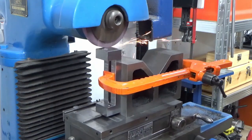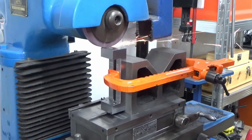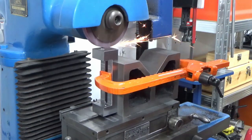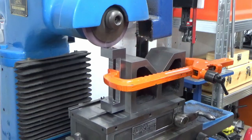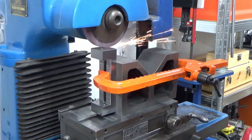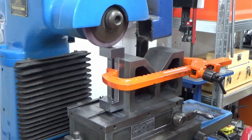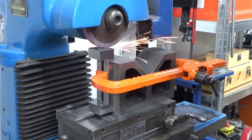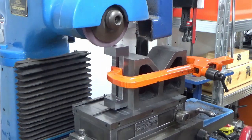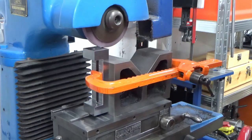This is me just grinding the back surface. I didn't really need to clock this and make it square, because you'd never sit the vice on this surface - this is where the actual vice screw sticks out. But good practice was to grind this surface first, then tip it over for the next operation, sit it on that surface, and grind the other end knowing I've got everything parallel and square on the final two faces on the ends of the vice. This is a bigger cut - a roughing pass, probably taking a couple of thou off this surface at this point.